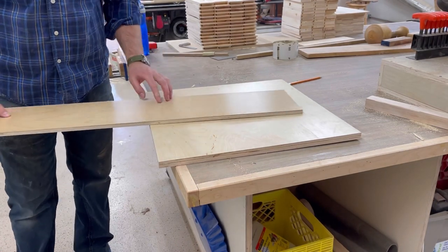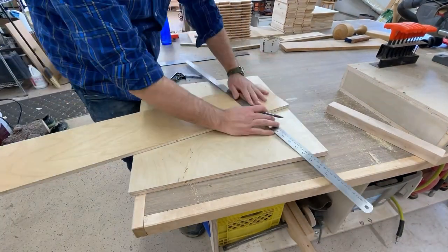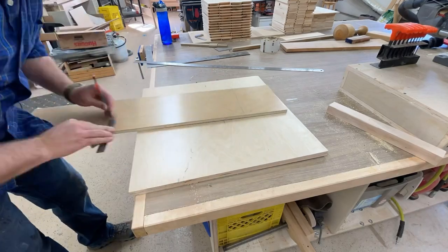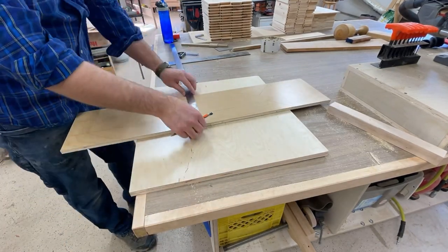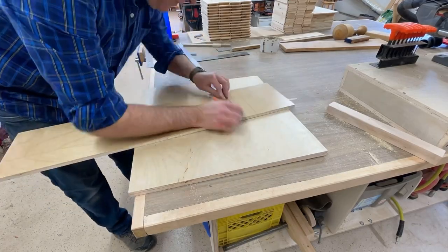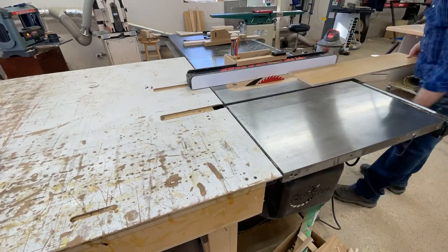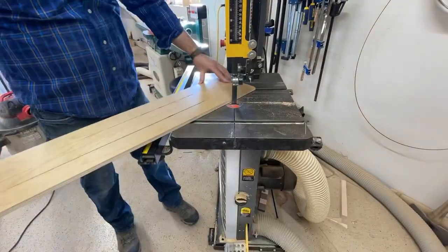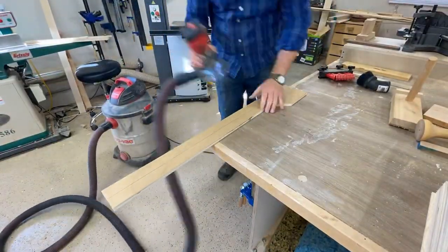One piece for the base on the saw and the other to make the handle. The square lines I drew are important for referencing off of later. I laid out the handle with kind of arbitrary dimensions — whatever felt comfortable — and put a center line on it. The center lines serve as the reference for the radius of your arc. Lining those two lines up with the leading edge of your blade ensures that the apex of your arc is at the cutting edge of the blade. I then rounded over the handle for comfort.